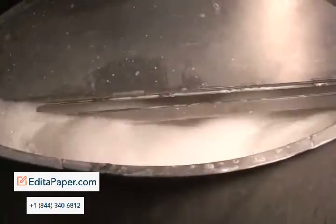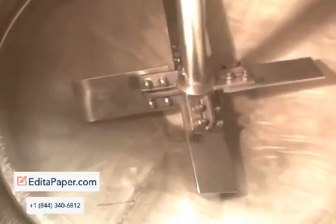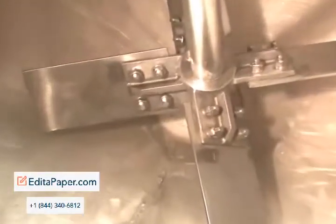The product is then circulated from the tanks through the lines and pumps and back. The boilout uses warm tap water as this system is not equipped with heating capabilities. After 1.5 hours, the boilout solution is discharged from the system and the tank is rinsed. The surface of the tank is effectively clean and ready to be returned to service.